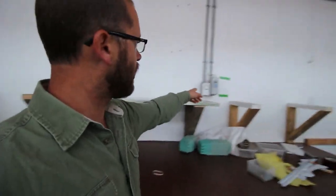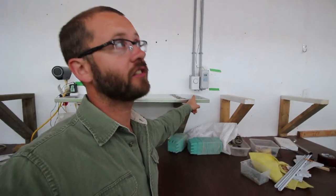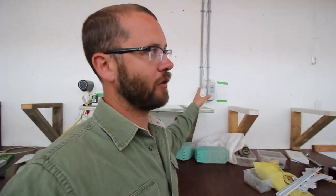All this is connected to a thermostat. There's a thermostat that comes on at a certain temperature — I've got it set so that when it goes to 25 degrees Celsius, it starts pumping heat underground. I actually got to hang out with a guy named Jerome, one of the guys that invented this idea of the climate battery. He was telling me that you don't need to pump heat underground all summer — it gets to a point where you can't store any more heat down there. So we just have it on a thermostat, and we'll probably run it until July or something.